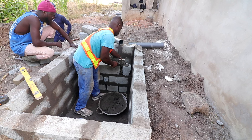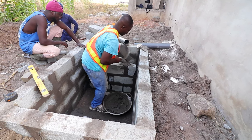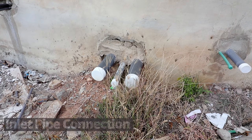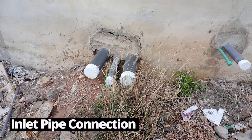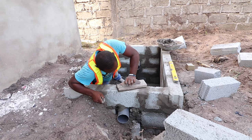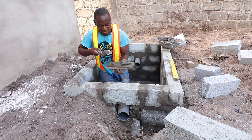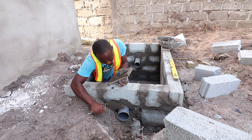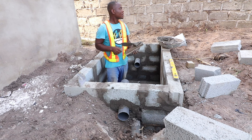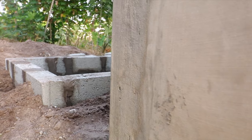This particular type of biodigester is a bit innovative and a bit creative. This is the first time we are doing this video to show how some of this is done. The inlet comes all the way from the top — there's a guest seat here, and one of the rooms from the top is also here. We decided on this location for the digester because we were thinking of having a pipe laid before the groundwork is done, with an end cap to the end of the building when the plumber is laying all the other pipes.